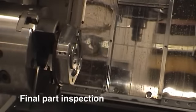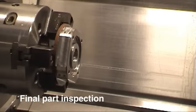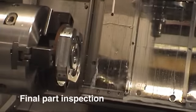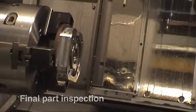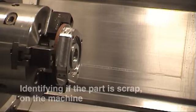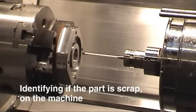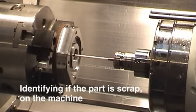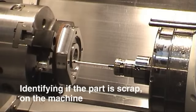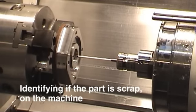With this type of machine, it does enable you to get very creative, with it being a 9-axis machine with 6 linear axes and 3 rotary axes. It does encourage you to throw the rule book away and dream up new ideas and new concepts to manufacture components. During the daytime, the machine is run as a twin spindle, twin turret chucking lathe. This is more for billet work that we can't produce from the bar feed system.